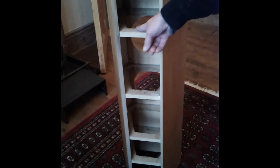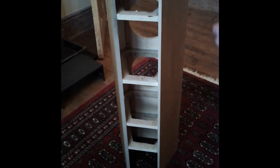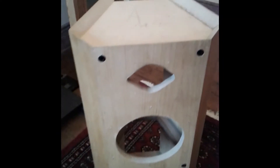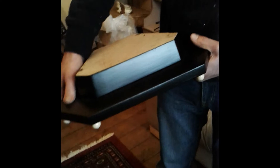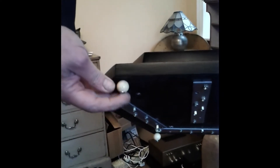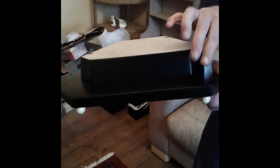The speaker's all together, all the braces are in, but the bottom one isn't in yet — I'm doing that last. All the holes are cut out, and it's going to have the top piece put in, which is set down slightly in the middle. I've also done the speaker stands. I've got these little beech beads with a hole through — you can buy them like that — and I've got a dome chrome screw in there. The weight isn't too tight because all the weight is actually on the screw. It's MDF at the right level — probably three bits of MDF to make that step the right height — and it's faceted slightly. That's a bit of pitch pine; I could have used a hardwood, but pitch pine is almost hardwood, so that should do the job.